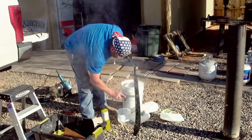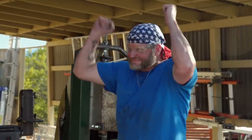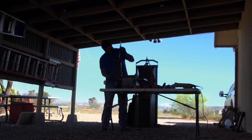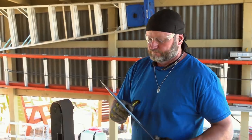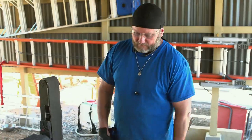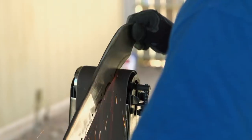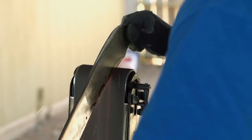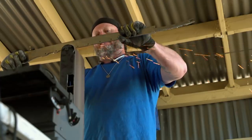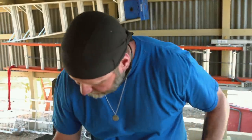I have no backups anymore. We've got a hard blade. It's straight. So as I start profiling the blade more, all of a sudden I notice something's gone wrong again — got a crack in the blade. I have no more steel to work with. So how do I fix that? I just decided to put scallops in between all of the eyelets for the rings and hopefully grind far enough down beyond where the crack is. No more crack. Doesn't look like the picture, but I kind of like it, tell you the truth.